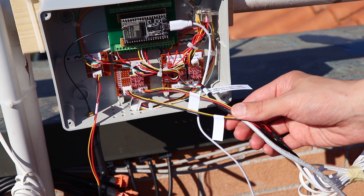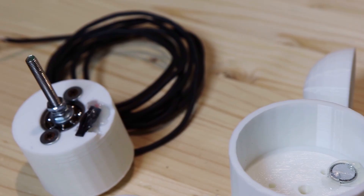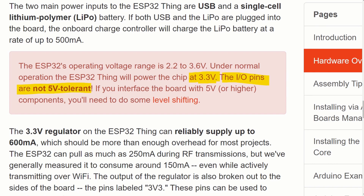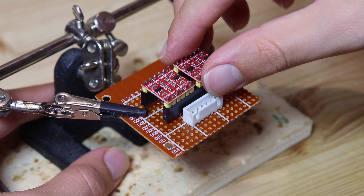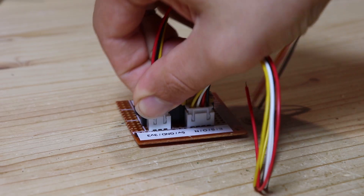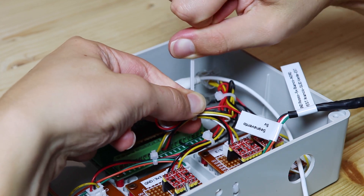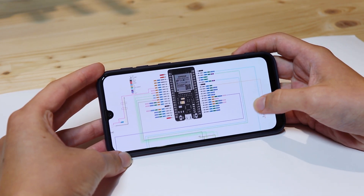Now we have all the other sensors coming in here with their wires. The temperature sensor connects directly to a pin on the ESP32. The problem are the hall-effect sensors of the anemometer, rain gauge and wind vane, which run on 5V, while the ESP32 runs on 3.3V. So to convert the signal from 5V to 3.3V, I will use level converters. To make things neater I soldered them onto a board. To make the connections I used JST connectors, which are way more solid than classic jumpers. Finally I connected together the wires for ground, 5V and 3.3V, and tidied up the wires with cable ties. In the description you can find the wiring diagrams and all the details about the software part as well.